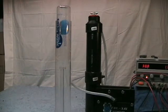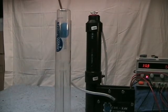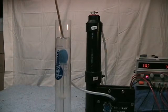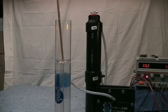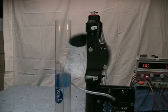I'll demonstrate displacing the air in the bottle and forcing water through it — that water is what we'll displace with hydrogen to get our reading. As I push down on the bottle, the air exits through the holes and water displaces it. It's very sensitive — even a breath into the hose will raise the bottle. You can see I'm filling the bottle all the way up.